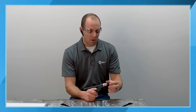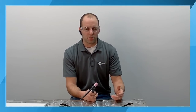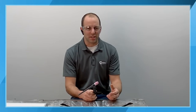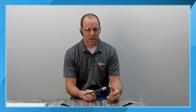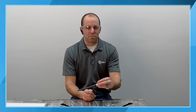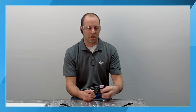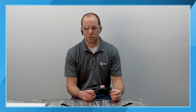There are a lot of different combinations with TIG welding based on your application. For most applications, if you're not doing any really critical work, a standard collet body is going to be your cheapest option. They're not as labor intensive to manufacture. These gas lenses have anywhere from 3 to 7 different screens in them, and they're all hand-packed. It's not an automated process. It's very labor-intensive, which is partly why they cost so much. The benefit is that it really provides that great laminar flow. Like I said, get on YouTube and see the video we put together for that. It shows some great color video and photography, and I think a picture speaks 1,000 words there.